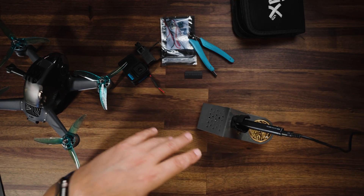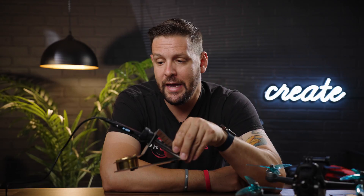You will also need a soldering iron. This is a very portable small soldering iron that can go up to 400 degrees Celsius. We are going to be soldering at 400 degrees Celsius — we want the hottest maximum ability to solder that we can, so we can make these joints quickly and easily and get out of there as swiftly as possible. With that being said, we need to tear down the FPV drone's top half to expose where we're going to be soldering.